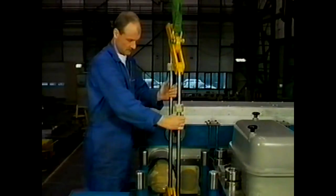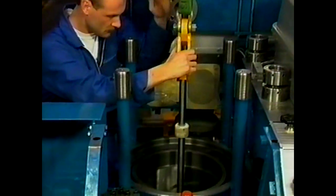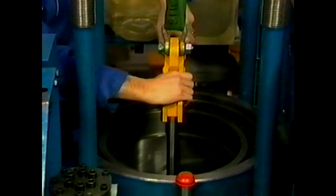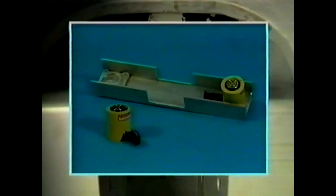Now place the hoisting tool in the cylinder liner in transverse direction of the engine and make sure that the tool is perfectly centred in the liner. To detach the cylinder liner from the joint faces, loosen it with two jacks. Turn the crank of the relevant cylinder to the bottom position so that the counterweights are located straight under the cylinder liner. The bridge piece and jacks are placed on top of both counterweights. Connect the jacks to the pneumatic pump and pressurise the jacks to push and turn the cylinder liner out.